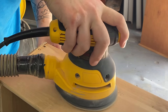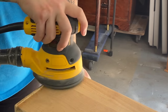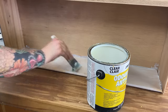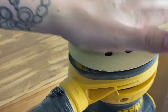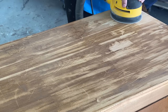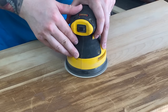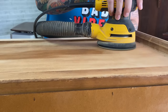I'm using a 150 grit sand pad here to sand pretty much the entire drawer smooth. Where there is a little bit of a smell I want to sand these down and reseal them. I'm using the other odor product from the same company, just a different method — I prefer using this for the drawers, it goes on a little bit thicker. I'm sanding down this top — there is some water damage but I'm fairly confident I can get it out with the sander as it seems fairly surface level. There are some deeper gouges too — I'm going to do two different sandings, one with 150 grit and a finished one with 220 grit.